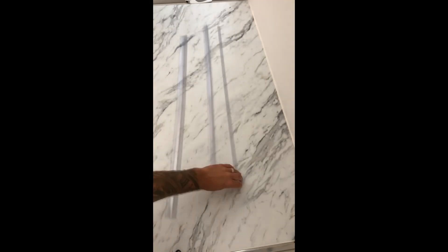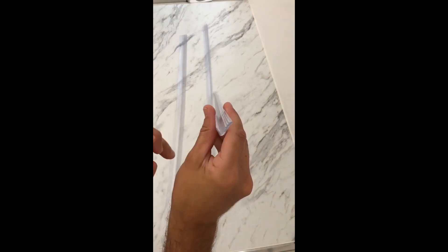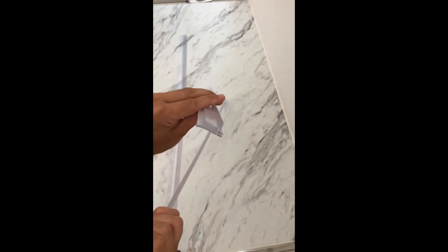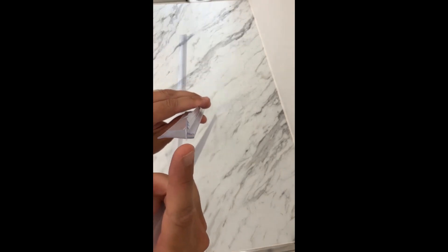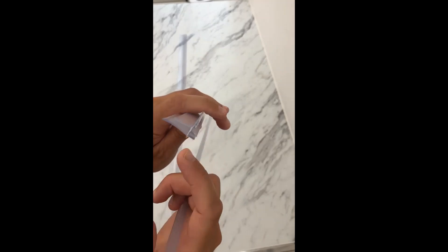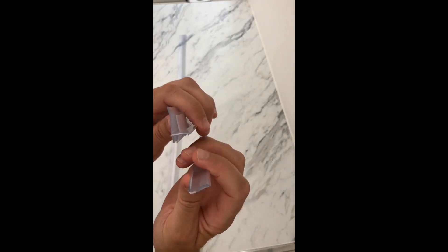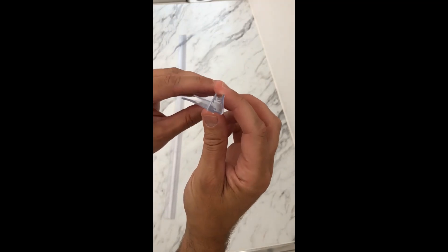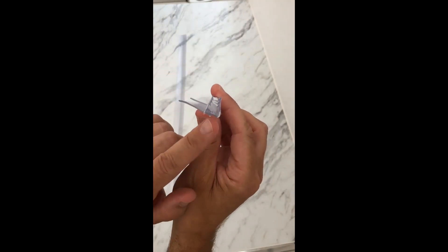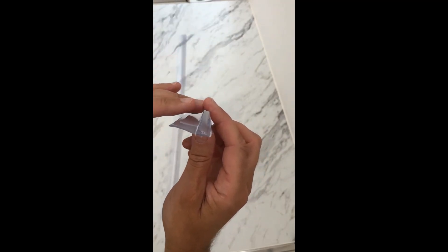With this configuration, you again use the hard plastic L-shaped piece, pushing the shorter part into the receptor. The other part of the seal is distinctively different — you can see it's more of an L-shape itself, with soft rubber blades coming off at an angle to the hard plastic upstand. Find the receptor part of this shower door seal, push the hard plastic L-shape into it, and click it together all the way through. That gives you the U-channel again to push onto the glass, and the two soft fins come off at a 90-degree angle to deflect water.